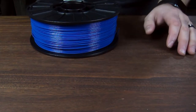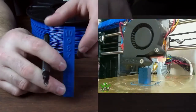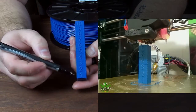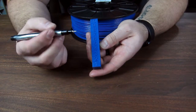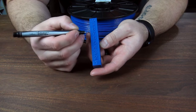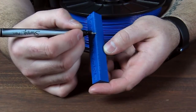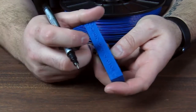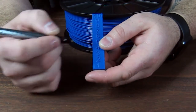The first ABS print is this calibration tower, just like the PETG. The ABS range according to Toner Plastics is 240 to 220°C. I started at 240 and incrementally decreased the temperature down to 220 at the top. I found the best quality to be right around 228°C, which is what you see here with the 7. The quality of the number is really nice. I do have some deformity on the side, but all in all pretty clean — it bridged that gap well, the side looks really good, and corners are nice and crisp. So I went with 228°C on the hot end.